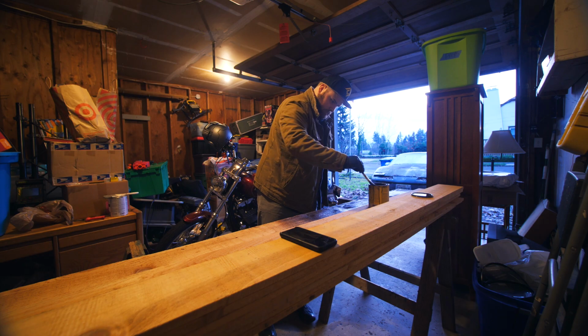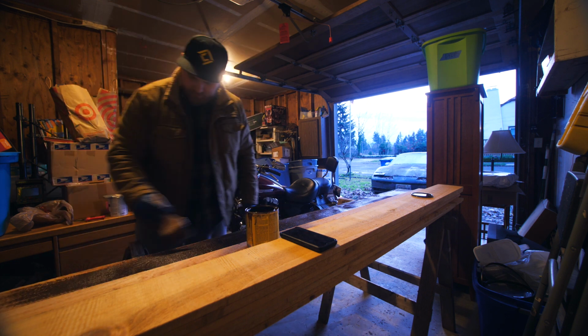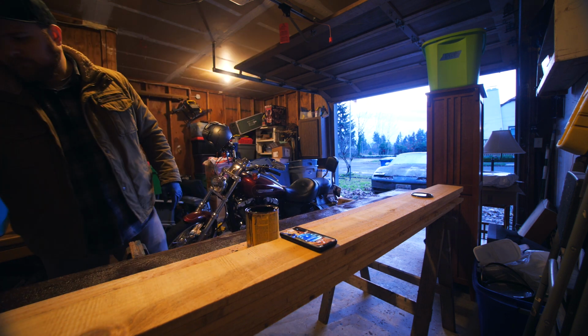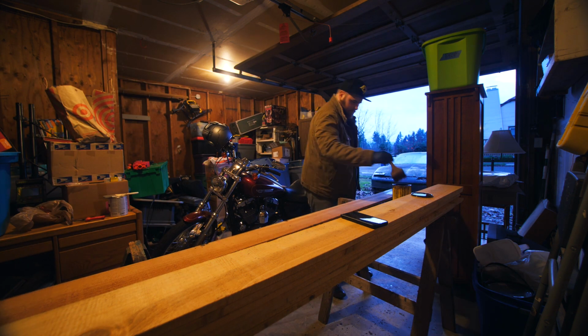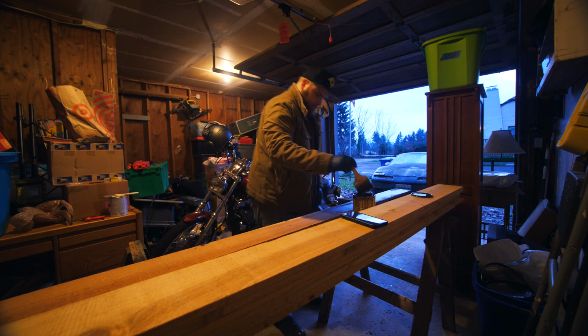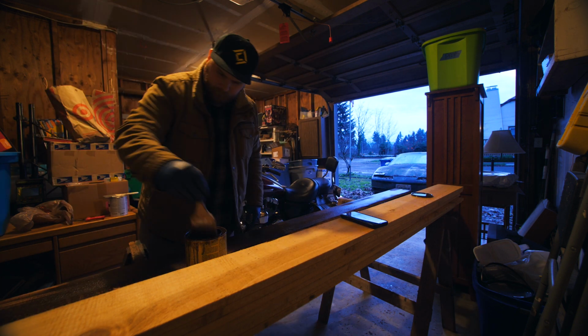That was easy. And then what I did next is I stained the wood. And when you're staining the wood, you want to make sure the material is dry. You're not outside in the cold rain. I mean, it's kind of common sense. Also a helpful tip, make sure you shake the crap out of that stain. So after I stained the wood, I let it dry overnight.